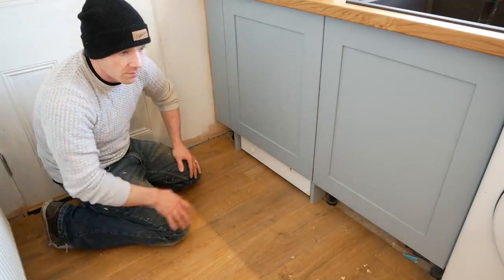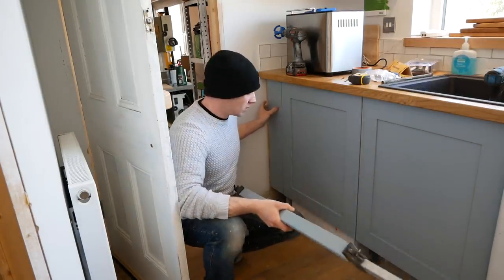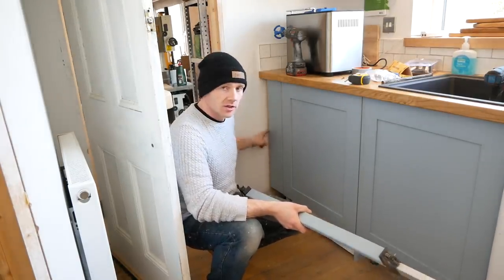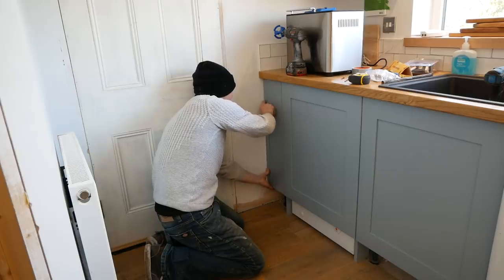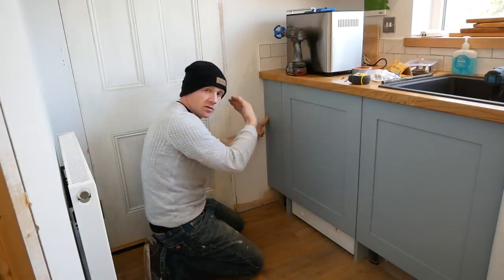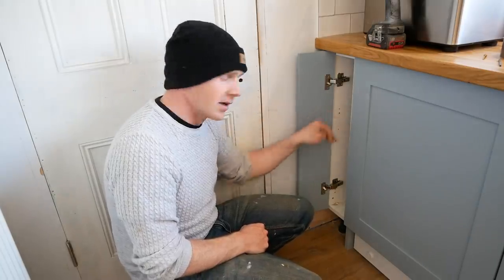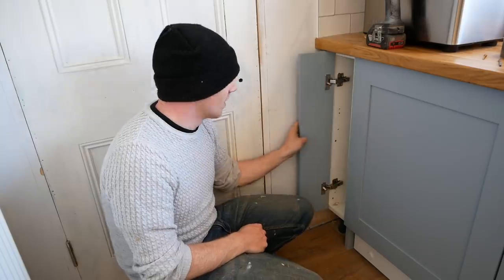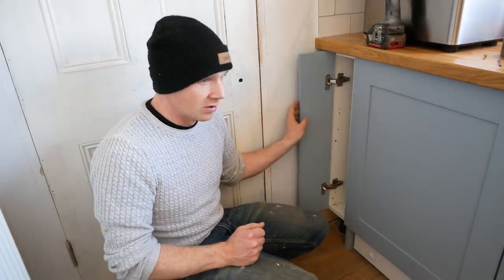So we'll make up some boards in a minute. Before we do that, I forgot to install our trim. I've made up a spare door, or spare kind of 150 door blank, so I could cut it down to do the scribed section at this end and that end. I hope that once that's up, and I've scribed it slightly to the wall because the wall wasn't quite perfect, we'll just have to adjust the door to snug it in a little bit so that everything's flush along the front. In the future we'll build a little skeleton shelf type thing that we can slide in there, and that'll take those. But apart from that, the trays for now might be quite an easy place to keep trays or oven roasting trays that you only use once a year.